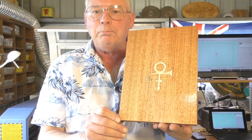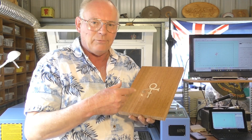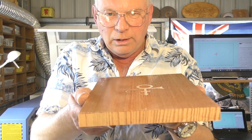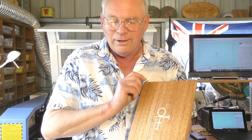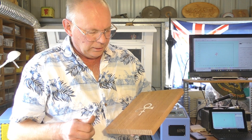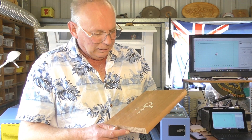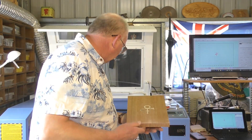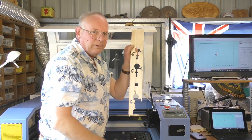So there you have a perfect inlay — first of all cut out with a laser and then etched out the cavity, fit it in, and look, it's perfect. Just lay it down that way so you can see. Of course I put a clear coat on it as well — absolutely perfect and it fits in to within a thousandth of an inch. I didn't have to really squeeze it in that hard, but you've got to be very, very careful, especially here. I will own up and say that I made four because I kept on snapping it right here on this little arm. And just to verify that, here are the different ones I cut out.